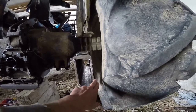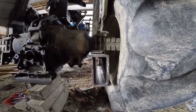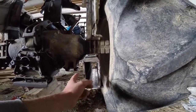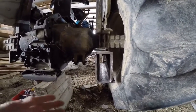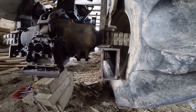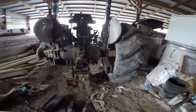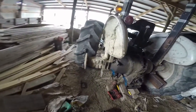It's 3 and 3-quarter inches from edge to edge. We could have found standard 4-inch box beam, however we need 34 inches from the inside edge to the inside edge of the other one, and we needed that extra half inch — or a quarter inch from each side narrower. I spent the past couple days drilling holes. We did that by taking the tires off. I've already done this side, as we can see. It only has half-inch bolts through it, but I'm going to drill the holes up to 3-quarters and go a little bit larger.